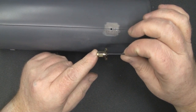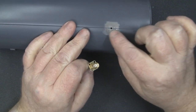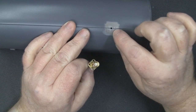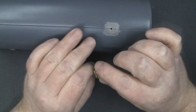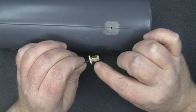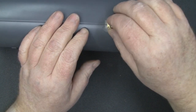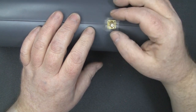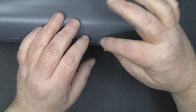I'm soldering the SMA connector onto the can rather than using bolts, which is much cleaner. I've cleaned away the paint from the can so I can solder directly onto it — and although these are called stainless steel holders, they're actually more of a tin and do rust. I've also cleaned the gold finish off the sides of the bulkhead connector down to bare metal, then applied heat to each corner to flow solder around it. You don't need excessive heat at all.